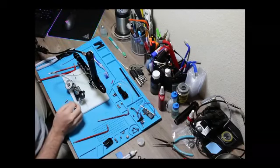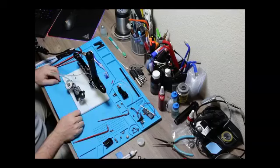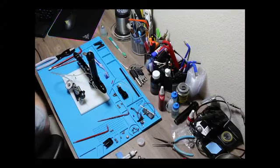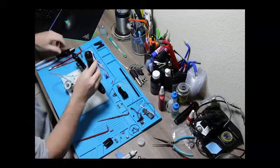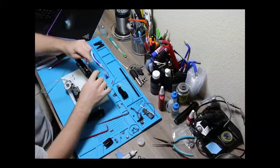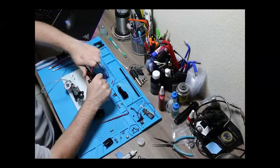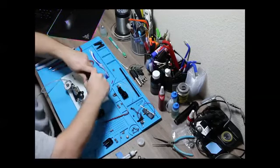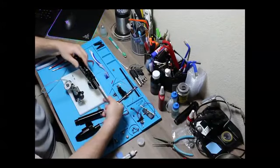Let's see. Okay, so what I need to do now is, that's what I figured is going to happen. So that rocket valve is stuck backwards. It didn't slide forwards, and the spring that I put in there, I don't think it has enough force. I was hoping that I could use a lighter spring and be able to use a little bit lower pressure. And that's what it's sold with, a lighter spring, but I'm pretty sure I'll have to adjust it.